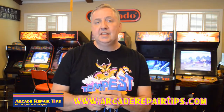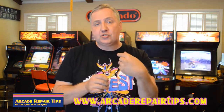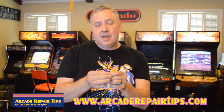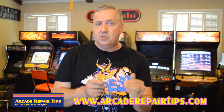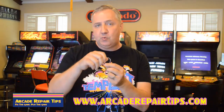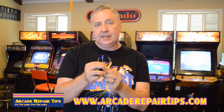Now as you can see in that demonstration, that was a really fast way of putting two wires together. We always tend to go clockwise — whatever your preferred method, make sure that it's consistent. But remember, your lights and ceiling fans don't move. How many times have we got a question: I moved my game and it quit working? Maybe it's because the wire nut came off. You can combine the two methods by putting some electrical tape around the wire nut, which will help hold it on better, but we're actually going to show you a more professional way to connect your wires next.